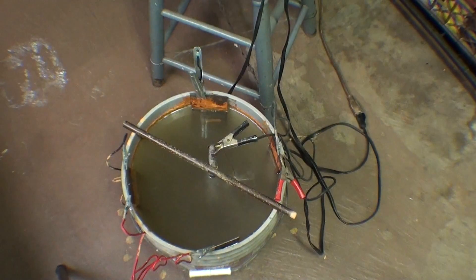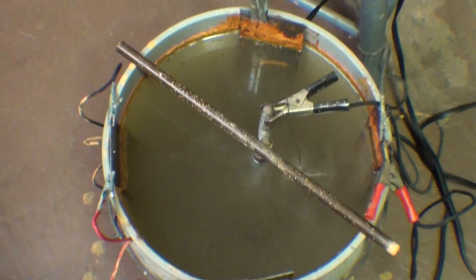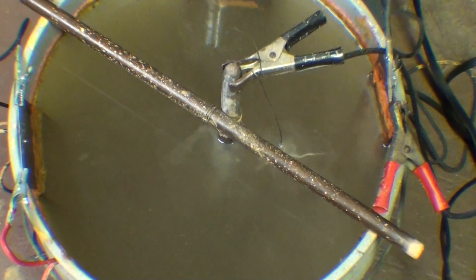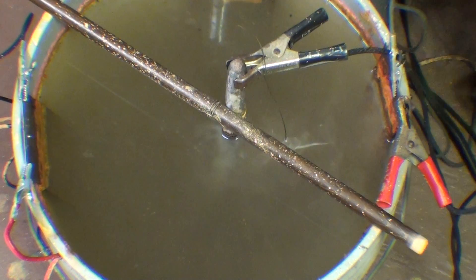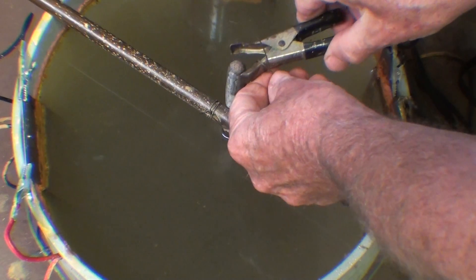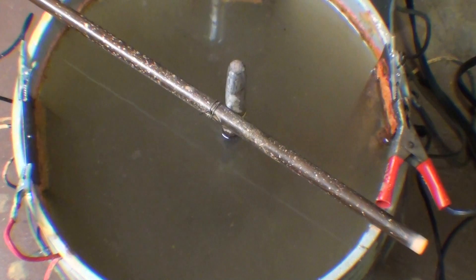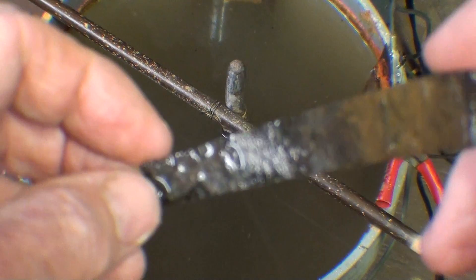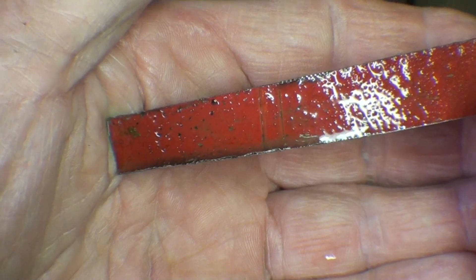It's 48 hours here on the electrolysis, and we're still at about 2 amps, and you can still see some action here. I added something yesterday off-camera. I'm going to unplug it — I should unplug it in case there's a spark, probably not very likely but you never know. That's a piece from my autopsy, and we'll see if that cleans up on that compressor tank.